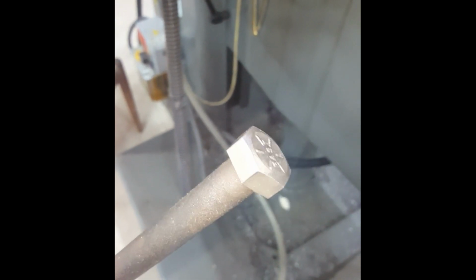It was a bit frustrating having to grab an Imperial 15/16 spanner to work these bolts, which is understandable. They're 5/8 UNC, but the originals had a 23 millimeter head on them.